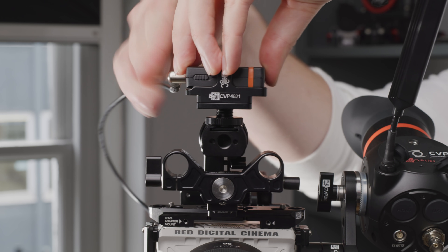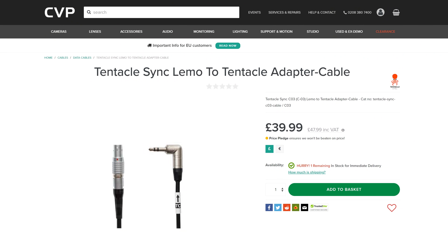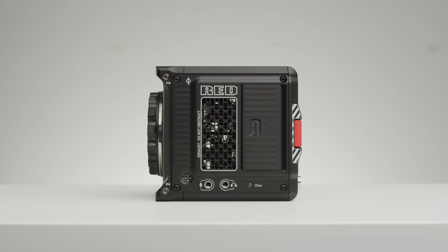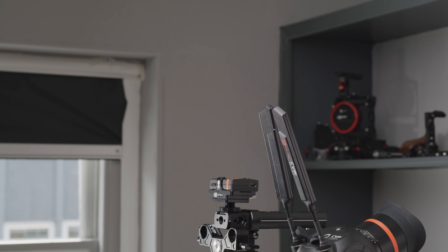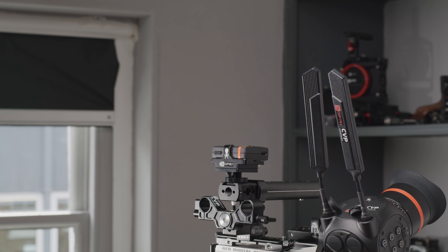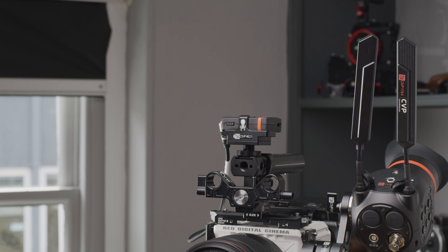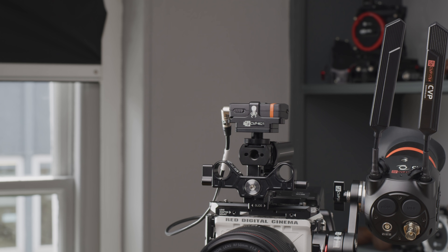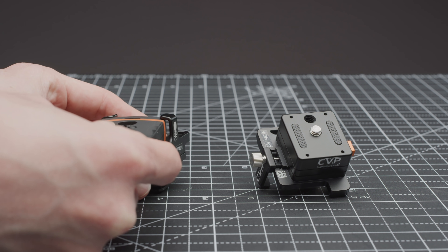Because this uses 3.5mm, we've created a custom Komodo 5-pin timecode to 3.5mm cable, which you can find in the description below. The Track E can then sit wherever you need it to be, whether that is on-talent or off-talent plugged into a powered shotgun microphone, as it doesn't support 48V phantom power. You can then pair these two units via Bluetooth to your phone and set your timecode and you're synced. One other huge feature is the addition of 32-bit float audio recording, which essentially captures a massive range of volume, so in post you can bring back what would normally be clipped or lost in the noise floor by normalising it in a programme like Audition.